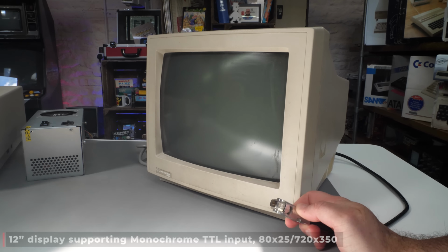It's not a powerful PC by any stretch of the imagination. It runs at about 4 MHz, the original speed of the IBM 5150, just over. Using a soft key combination on the keyboard, you can actually double the speed, or you can put it into turbo mode, so you can go to around 7 or around 9 MHz. It's very Commodore. There's no turbo button on the case. You just do a key combo and it beeps at you to tell you what mode it's in. So about 9 MHz top speed.